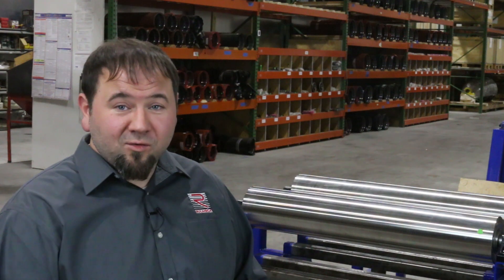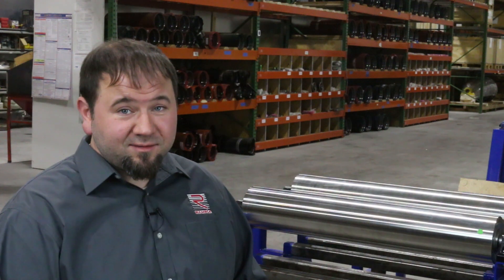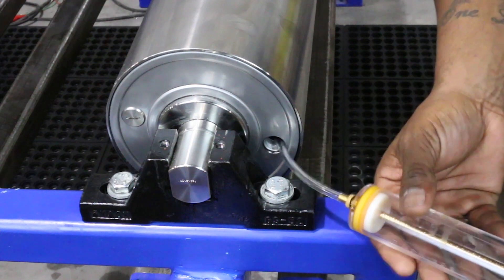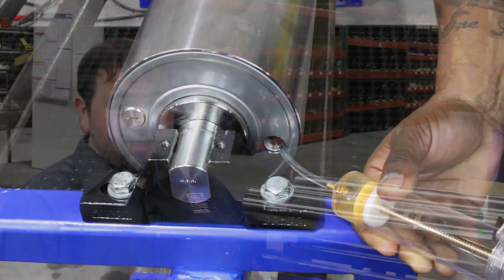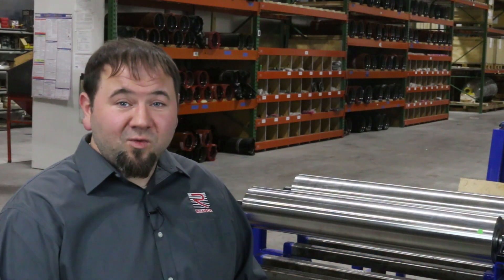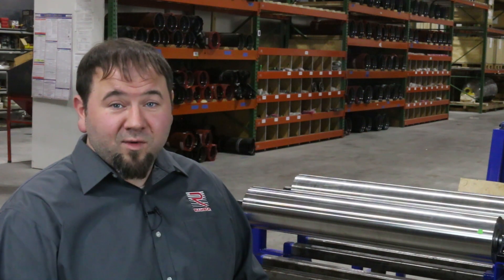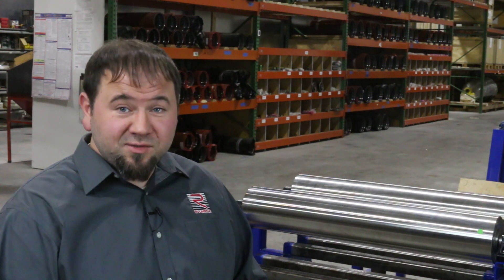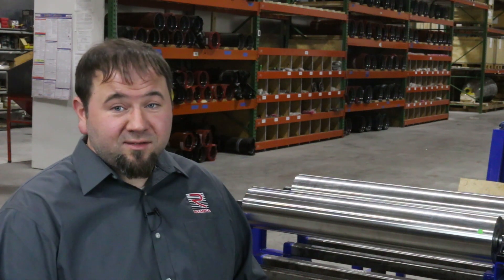To check the condition of the oil, remove an oil sample from the lower hole and examine its condition. The oil's cleanliness is always the best guideline regarding the wear and condition of the gears and bearings, and whether to change the oil immediately or delay the oil change. Note that the actual quantity of oil for a given pulley model and face width may vary with motor power and shell profile. Therefore, it is essential to determine the actual quantity of oil required prior to beginning the oil change.